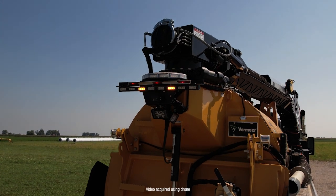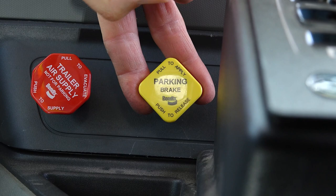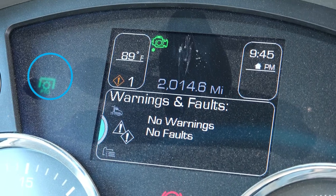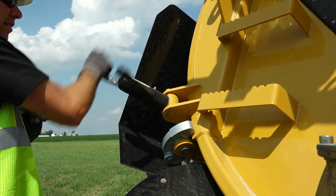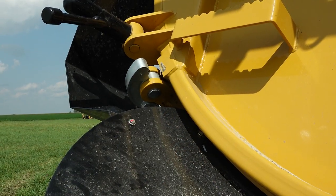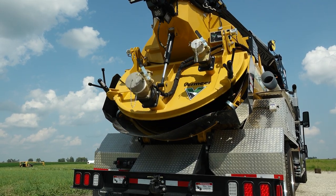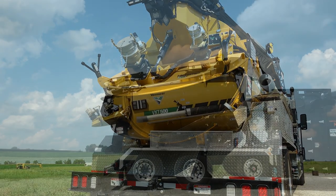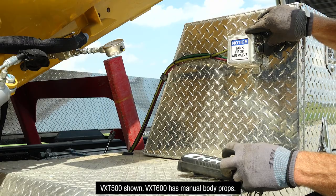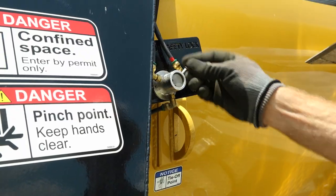When unloading the debris tank, the truck should be parked on a level surface that is compact and stable. Properly secure the work area and activate the strobe lights if needed. With the engine running, ensure the parking brake is set. Push the PTO-1 rocker switch to engage the hydraulics and verify the light illuminates on the dash. Grab the remote and exit the cab. Manually disengage the door safety latches from the rear of the machine. At a safe distance from the truck, turn on the remote. Verifying the area is clear, release the latches on the door by pushing the door lock to the open position. Push the door to the open position until the door is fully opened. Engaging the hoist to the up position will raise the tank and allow it to reach its full travel. If the door and tank need to remain in the open position, engage the body prop support and air actuated door locks.